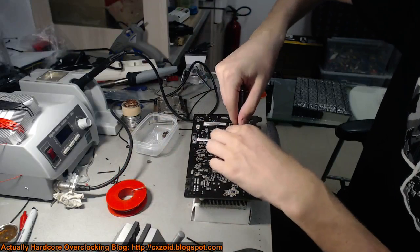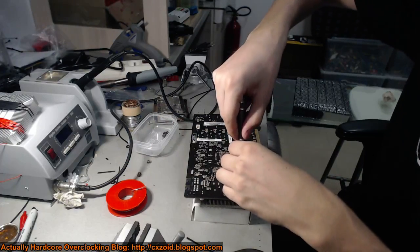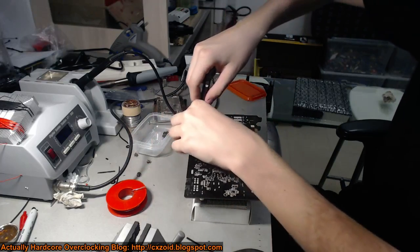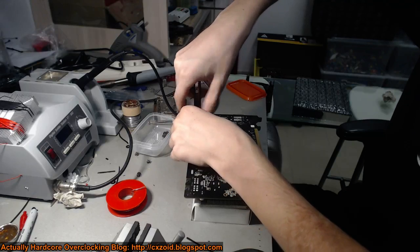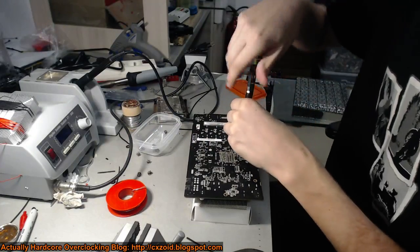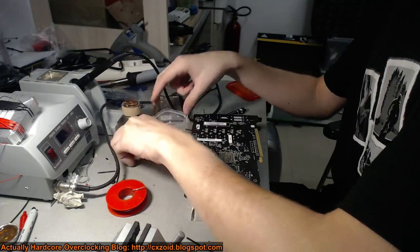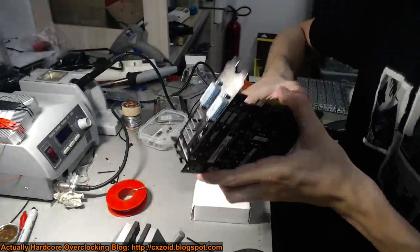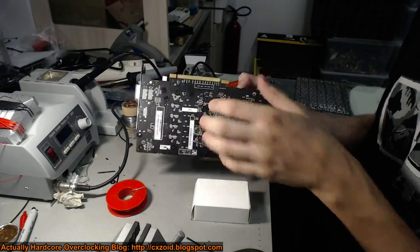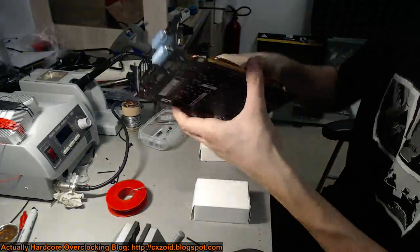Just directing Mr. Guest to help me with the Windows install. So you just pull off the six screws - your VRM and your core, because those are all integrated into each other. Your VRM heatsink is literally just a plate dumping heat into the fin stack of the core heatsink. And now the card comes right apart. I redid the thermal paste myself - as you can see, that's actually a pretty good thermal paste job.